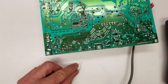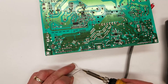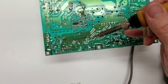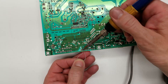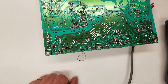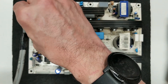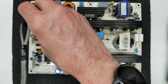I'm going to add a resistor here. I found a 1K, 1000 ohm resistor. I'll tin the leads to make sure they take solder well, then tack the resistor on gently. I now have a 1000 ohm resistor between pins three and four. The board is resting on a rubber pad which is insulative — I've tested these pads at up to 1000 volts and they were fine.